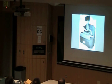This is a neat machine made of granite that we used for this purpose. It's built in such a way that we've got slides moving crosswise. They're air slides. They're propelled by linear electric motors. There's a slide moving up and down. So we've got 3 coordinates. This was used for measuring things. And one problem you have with a machine like this is you don't want your servo and its magnets to hold the whole weight of the vertical slide. So what we have up here is a boat in a little tank that supported the weight, heavy fluid that just held it up. And you can see John Mader hasn't changed a bit since that picture was taken in the early 80s.